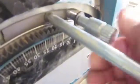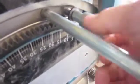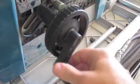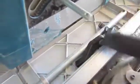And then you can adjust this so that in a little bit less than 3/4 of a turn, it could go from completely loose to fully clamped. So why not do it that way, instead of making a struggle with this spring, which I'm pretty sure is why that tooth is broken off. So I figured I was going to fix it anyway. Instead of doing this funky little maneuver, because when you're doing this, your hand is always getting interfered with by this part. You try to turn it, you're just making that go, and that's just not good.